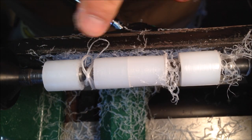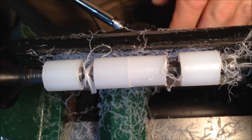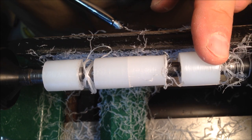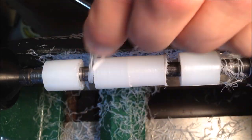I'm happy that they're trued up fairly well. I'm going to turn the camera off, clean all this stringy stuff up, get it all cleaned off my lathe, come back, and we'll turn these into the conical shapes we need to help them self-center on any size brass tube.